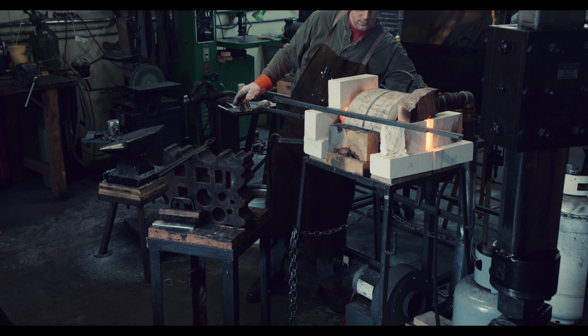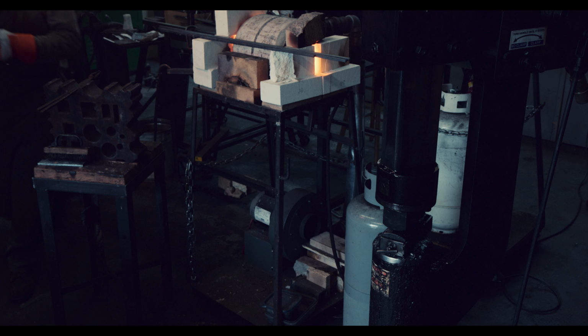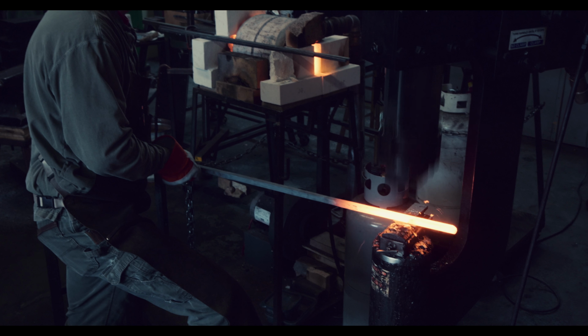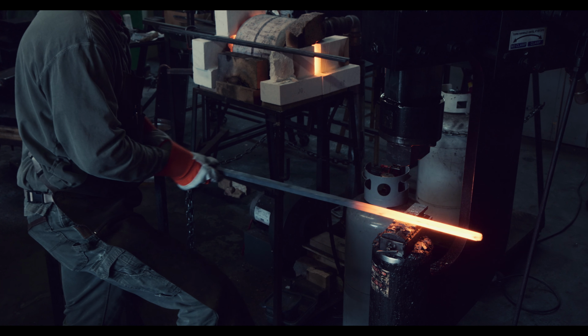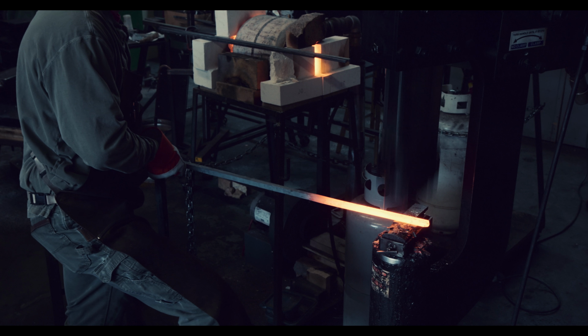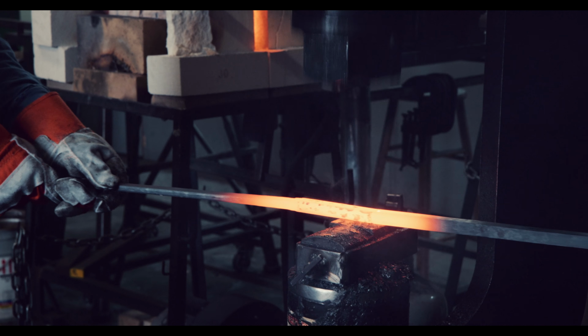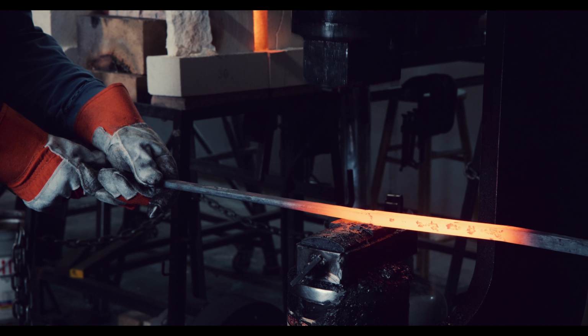As I just told you, my bars for constructing swords or saxes are always 3/8 of an inch wide. Also, this video is about a broadsax, and to achieve the width of this blade, I will forge the 1/2 inch cutting edge bar flat to 3/8 of an inch. This will significantly widen the bar that will form the cutting edge. If you look closely, you can see where part of the bar is much wider already.